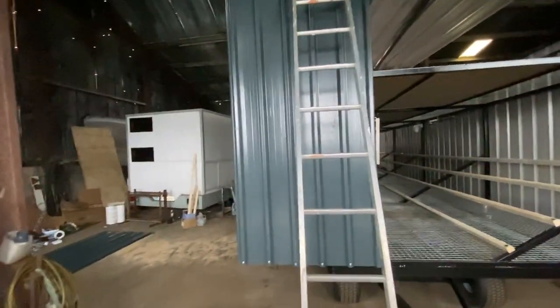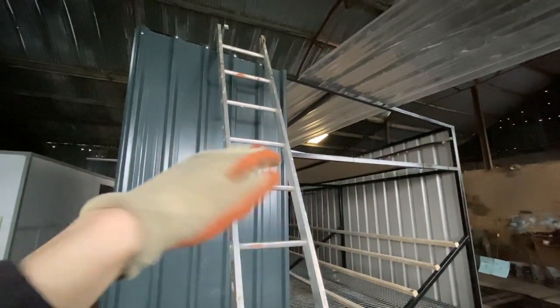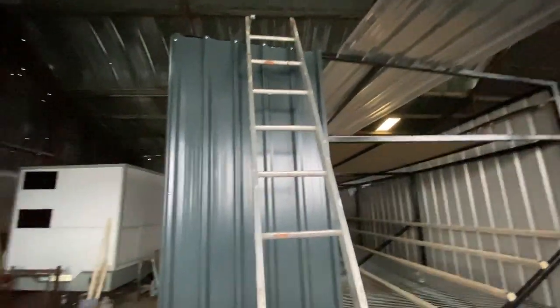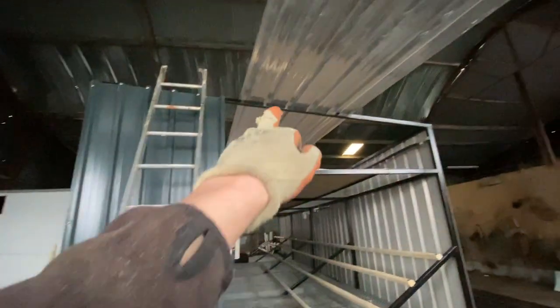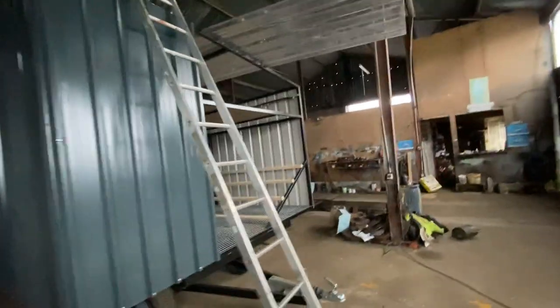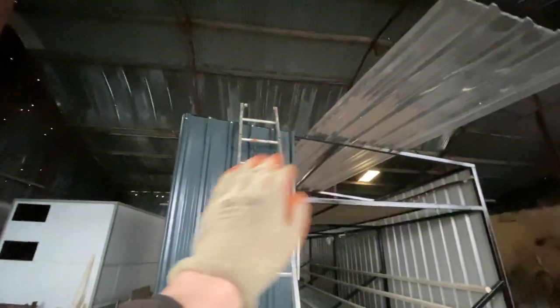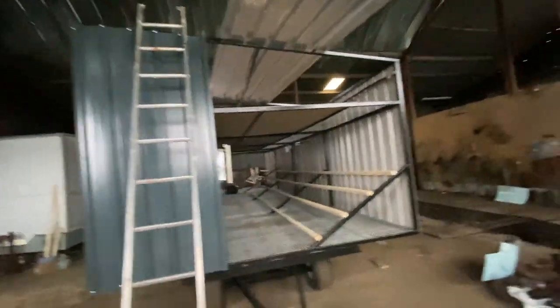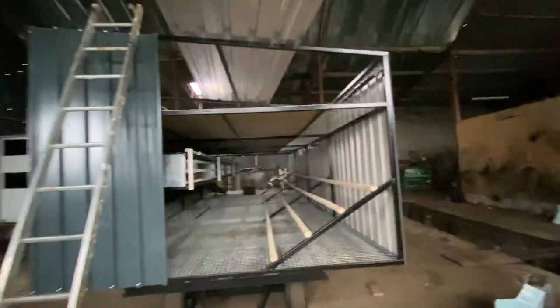How I do these end sheets is I screw it on with just two screws, go up and mark where I need to cut it. Because there's only two screws holding it, I fold it out like a book, cut it three quarters of the way, and put it back in. I screw on this side, take out the two original screws, fold this side out and cut this side, then screw it back on — so I'm not up and down and up and down. While I was putting that on, I was thinking to get up the roof sheets I should probably put them up now when I can push them up on this nice smooth painted box section, because if I try to put them up over the top I'm going to scrape the paint off. I'm going to push the eggmobile back, load all the roof sheets up there in one pile, move them towards the back, and that way I can sheet towards the back. Being a bit more prepared saves extra work.